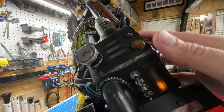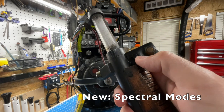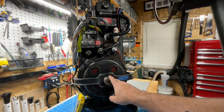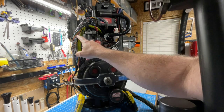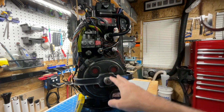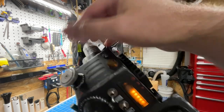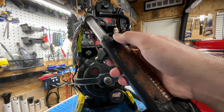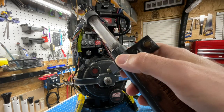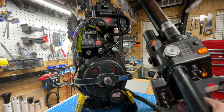I'm going to prefer video game modes for this reason: spectral modes enabled. This is a new feature called spectral modes, which only works if you have RGB LEDs for the cyclotron and RGB power cell lights. If you have the stock HasLab equipment you'll see no effect. At level five I press to set and save — pressing the other button would just erase and exit. Saving settings and exiting the EEPROM menu now.